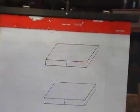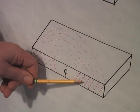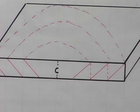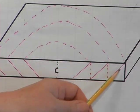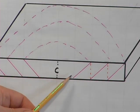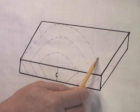Your success in this project really requires that you have a clear understanding of how to lay out the rings, the relationship between the angle of the rings and the distance between the rings. So I've drawn a few sketches to help you understand this whole process, this whole technique. In my first layout, I've placed the bandsaw cuts at a 45-degree angle. Notice the vertical dashed lines. These confirm that the bottom diameter of each ring matches the top diameter of its adjacent smaller ring.